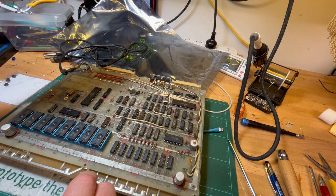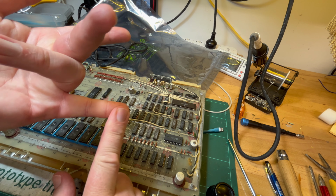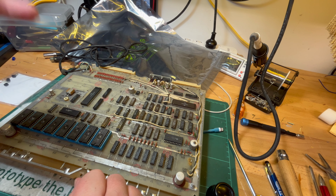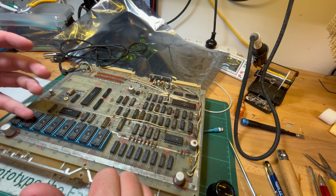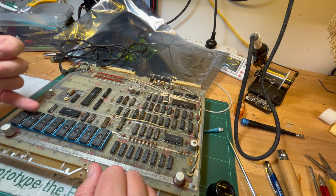So I'm just trying to think. When it's a ROM issue, what could the issues be? Okay, it could be an address line that is an issue. In which case, I assume all of these have got the same address lines. In that case, I shouldn't be seeing the question mark SN, should I? Because that's obviously coming from the character, unless the character ROM's separate. But I'm assuming the address lines are working. Of course, it could be one of them is a broken pin. The other thing is it could be data isn't something. I don't know. I'm just rambling.